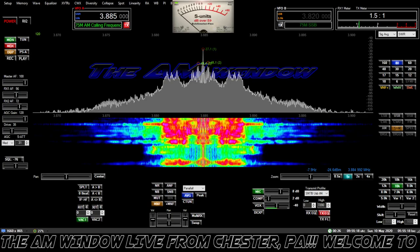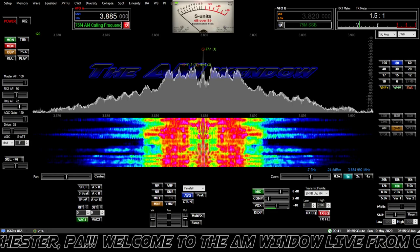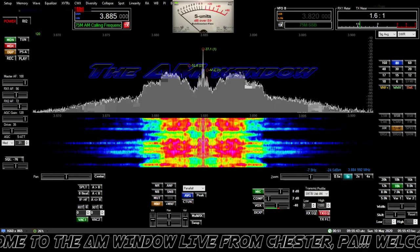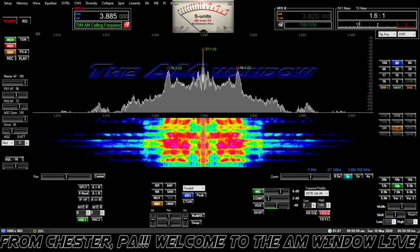I like listening to old buzzards. I like listening to long transmissions, and you make some long ones, Dan. I'm just curious what power level you're running, because that thing's got to have some nice cooling in it, because this 3CX1200 gets hot. I'm feeling the exhaust temp right out of the top of the cabinet, an inch from the top of the tube, and there's a chimney blowing all that air directly off basically the anode of the tube. I never had a ceramic tube amplifier before, so I was just wondering if they just run hot. They're a little different than glass tubes, so in my inexperience.